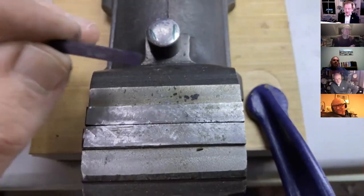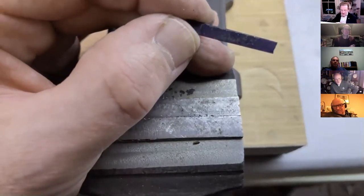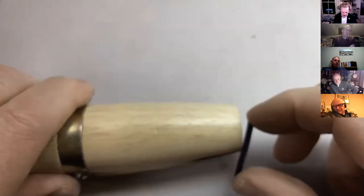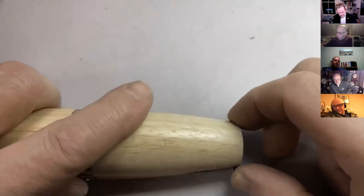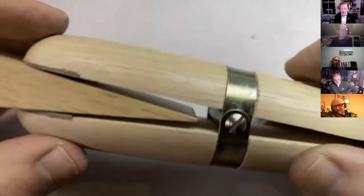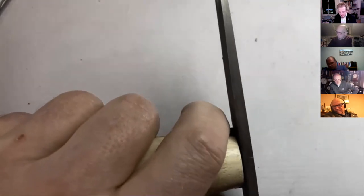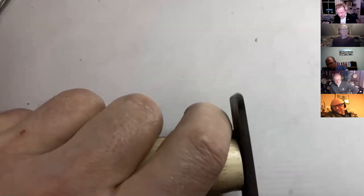And if I can find my latest new toy, very, very last thing today, thank you for bearing with us, I can't remember how we got to talking about this, but I bought one of these jeweler's ring clamps. Work holding is always a kind of major challenge. And I thought, for this project, what would be really good would be a jeweler's ring clamp, because I can hold the material nice and flat. And you see how it works. It's just got a wedge in here that you tap in like that. We can hold it without hurting our fingers. And now, because this material is annealed, I can just file the edge of it and file the burrs off.